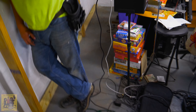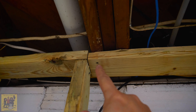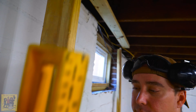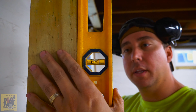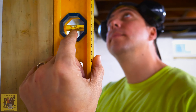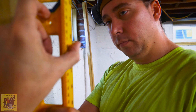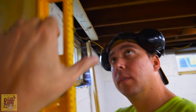This is what we did: we made sure we got the bottom straight, and then we put the top — Chris fastened the screw right here so it matched the end, then went down to the other end. And then we can just throw a level on it like this. Yeah, it ain't perfect but it's pretty close — a little off, but that's where you got off. So just be aware of that. Then you can just level that and run your screws in.